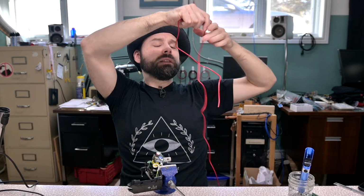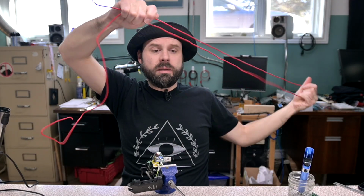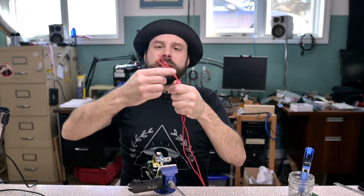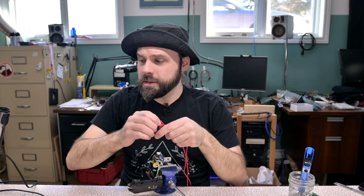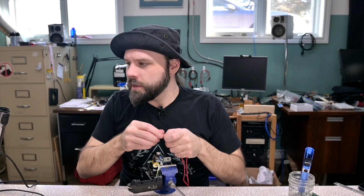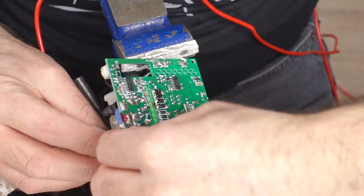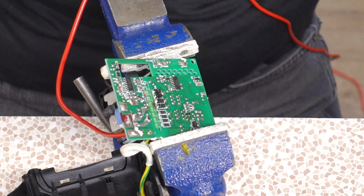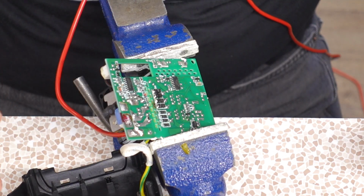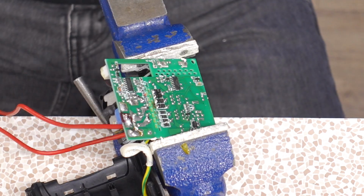When I have a continuous piece of wire and I don't know how long I'm going to need, basically what I do is I get both ends of the wire, right? So that's a loop. This is just both ends. And I'm going to connect this in one continuous loop. So you get the wire through the hole, give it a little foldy over. This is a nice 16 gauge. I'm replacing, the original wire was 18. 16 is gonna be able to handle the lengths that I'm doing no problem, right? So I got one end of the wire, and then this end of the wire.